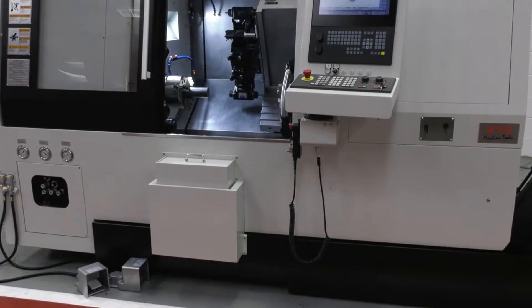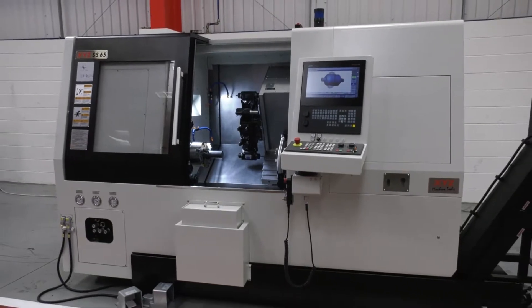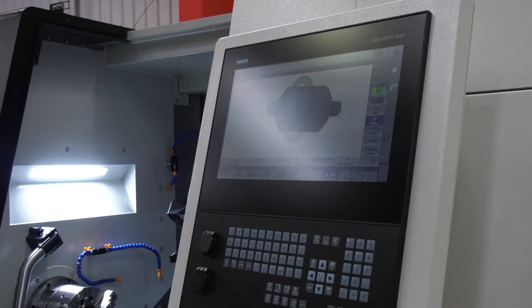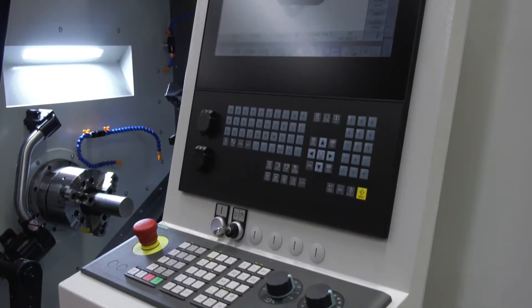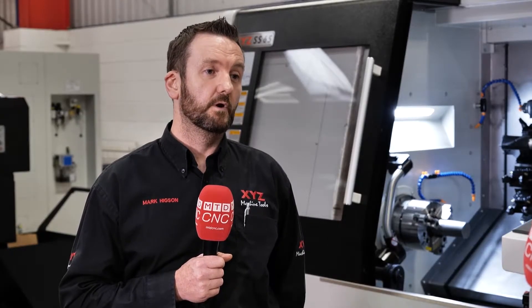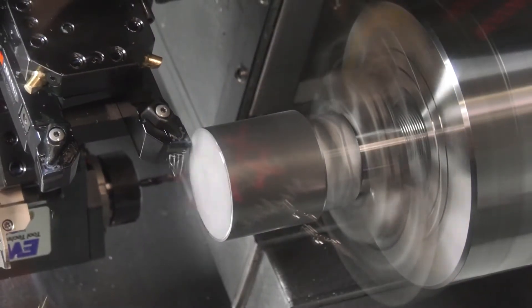And your control here — this is one of the things we talk to your customers about in the field and they really do love these touch screen solutions. If you were new to a one-hit machining environment, how easy is it to program? Well, it's the Siemens 828D conversational ShopTurn control, which lots of our customers are used to on the turning centres. The control is absolutely identical, programming is exactly the same. The only difference is the small cycle to transfer from one spindle to the other — it even mirrors the axis so you're still programming the cutting in the same direction.